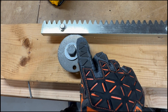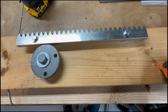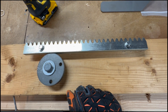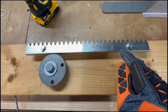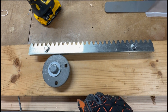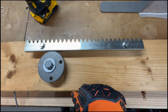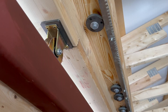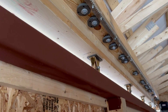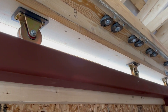My plan is to put one of these cams for about every lag bolt we have, all along the length of the track. In the future, should we need to adjust it, I can loosen the cams, rotate them to minimum distance, adjust the track the way I want it, and then backstop it again — even more reinforced. The camming supports are now installed in the observatory and you can see where they sit behind each bolt on the track all the way down the length.